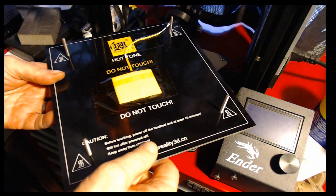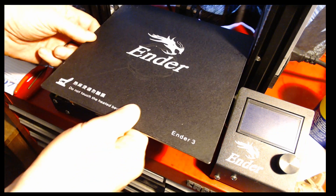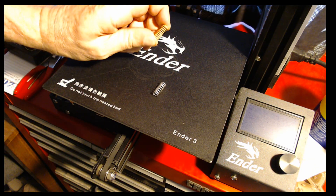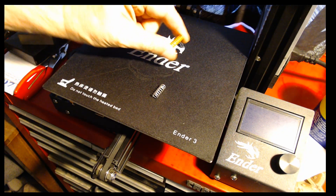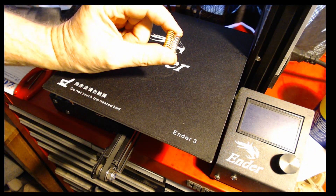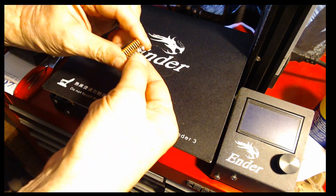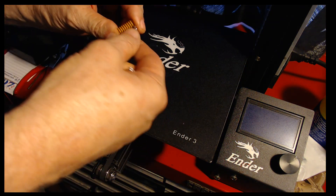Let's compare these real quick to the new ones. There's one of the stock ones, and there's one of the new ones. You can see how many more windings the new one has — that means it's going to be a much smoother spring. They're about the same length, but they have a finer wire and far more twists in them.